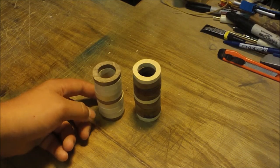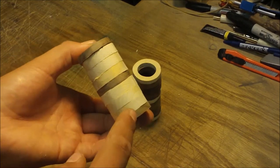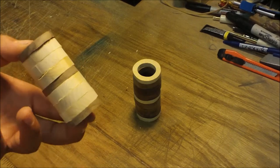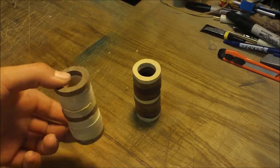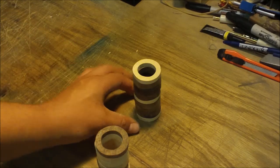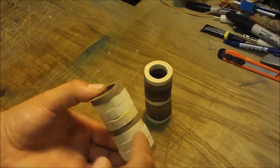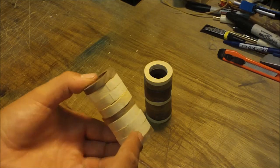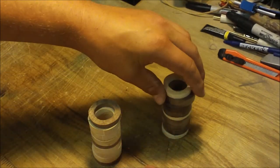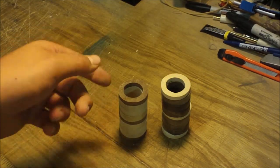I'm off the scroll saw and I've stacked them up to show what they will look like. As you can see, this is the maple base — this will be the salt shaker — and it has the contrasting rings at the top, middle, and bottom. I haven't cut out a bottom yet but I'll make that out of some eighth inch walnut to blend in with the walnut quarter inch bottom. Then I'll use a maple top on the salt and a walnut top on the pepper, so the shaker with the most maple color will be salt and mostly walnut will be pepper.